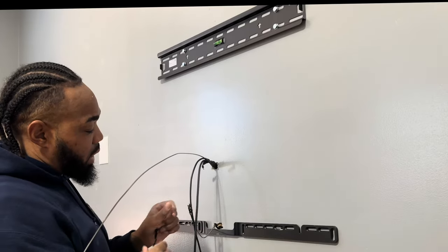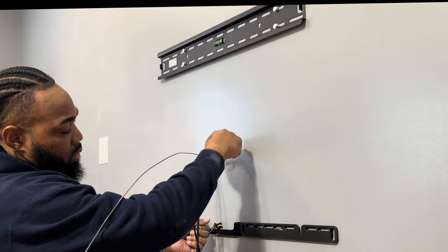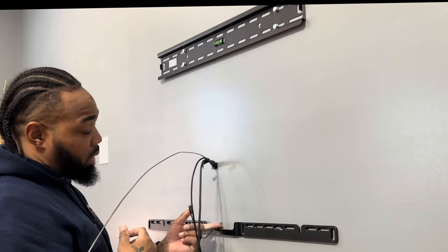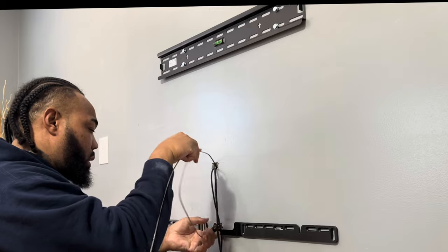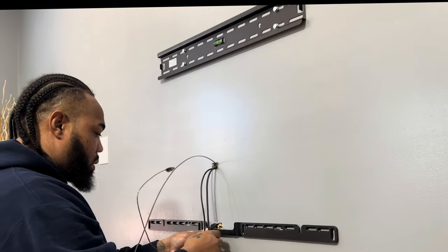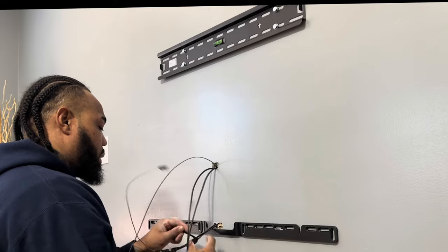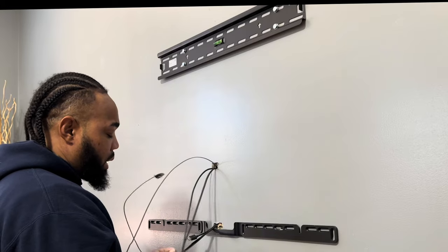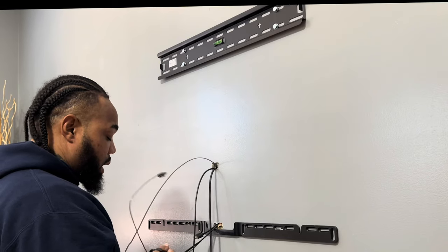So all I did to get my fish rod down in — I brought the fish rod to the wall and I said, okay, it's from here to here, and I put like a bend where I wanted the bend. So I fished it down and it came right on out. Sometimes you can take your finger and pull it out. So I'm going to go back and show you how I bent the fish rod to go inside there.